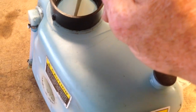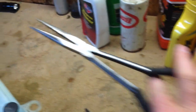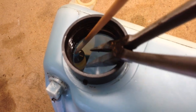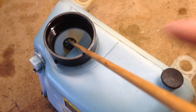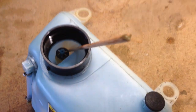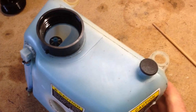Put the retainer on, let it slip down, and while you're holding that on there, I had a pair of real long needle-nose pliers so I could spread them and get on either side of the retainer clip, and get down there and start pushing it down until it catches. Once it catches, you can go with a stick on one side and a flat blade screwdriver so you can use both hands, and you just work that down, and it will come down and rest on a flange. Then tip it up, and the float goes up and down just fine.